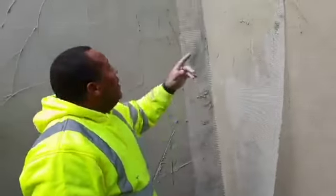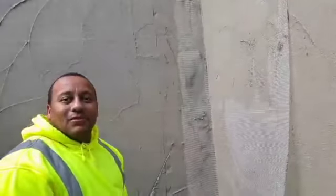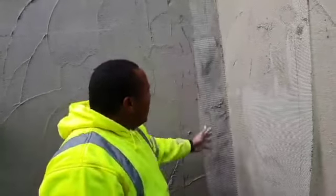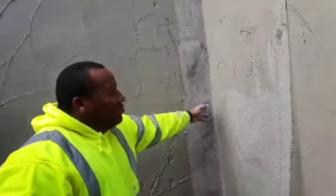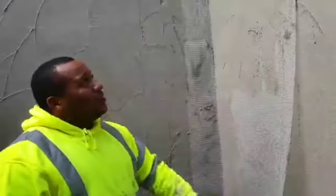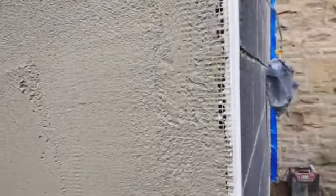And the beauty of this is when I now put my strip from the top peak coming down, it's already overlapped. It's already going to be overlapped because it's nice, you know what I mean? So I'm still going to work it in tight, so that corner is going to be overlapped by 100mm still, and it's going to be all nice and mint, nice and tight. So that's how you mesh a wall, like that, and that's how you do an internal corner like that. That's how you finish the top beam. Easier. Now I'm going to finish this off.